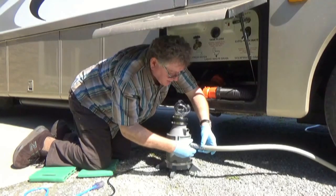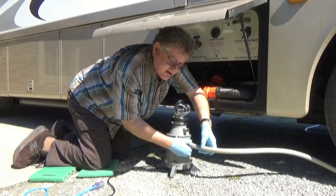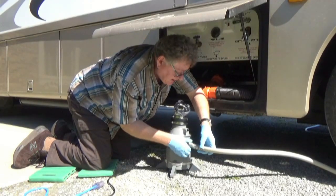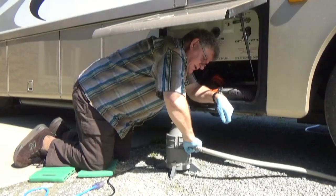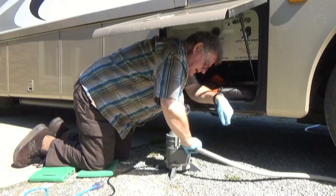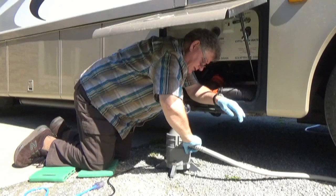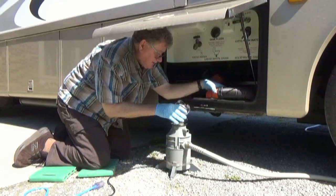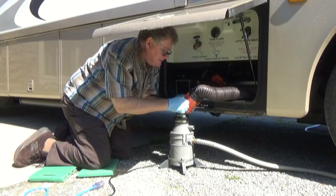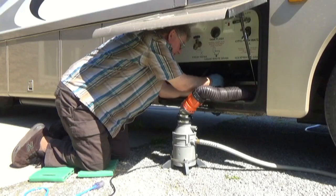It's pretty simple — you hook up your hose. This is a hundred-foot, three-quarter inch diameter hose. It will go seven or eight feet of elevation change, so if the site you're dumping is higher than where the RV or camp is located, you can go uphill to the dump site. If you don't have a septic tank, you can go into a toilet if it's on the ground floor or close to elevation. You hook up the garden hose there, hook up the standard RV bayonet mount, get it all hooked up, check for leaks, make sure everything's tight, and you're good to go.